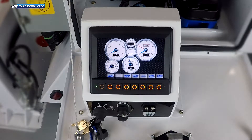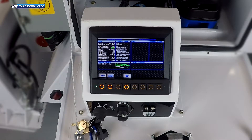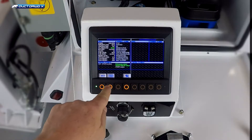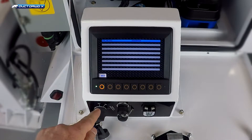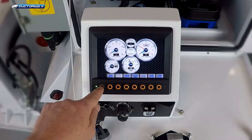The operator can check the status of the engine functions by pressing the engine status key. The engine status screen provides data about the hydraulic engine including temperature, oil pressure, RPM, alternator battery voltage, number of hours on the engine, the fuel level, regen level, and the percentage of soot load on the DPF filter. Error codes can also be reviewed by pressing the error codes button. Press back to return to the main screen.